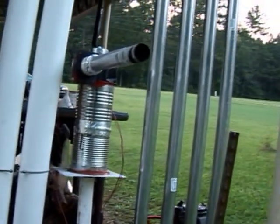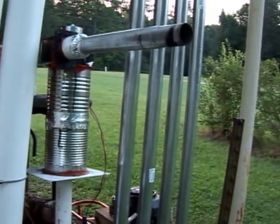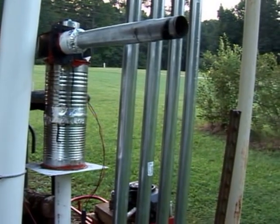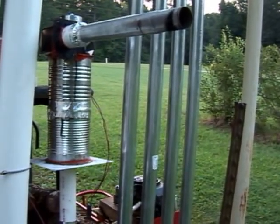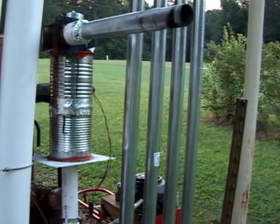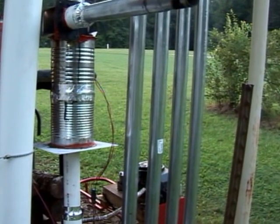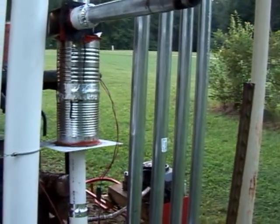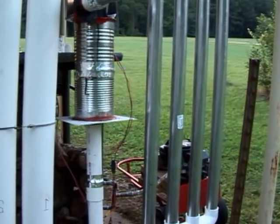Here's my fan. The fan is mounted onto two number-ten size cans, and in the lower can I filled it up with wood pellets. That kind of filters out some of the tars to keep my fan from gumming up, and it also collects a lot of moisture too, but mainly I'm after the tars.